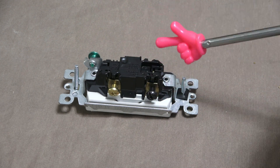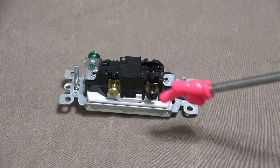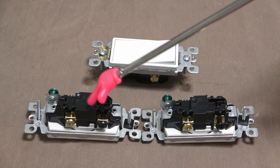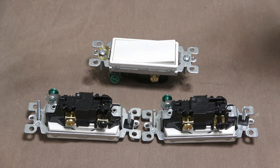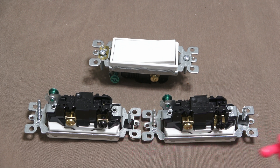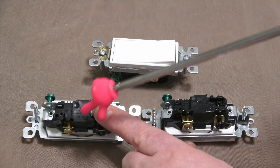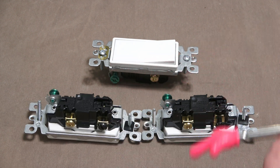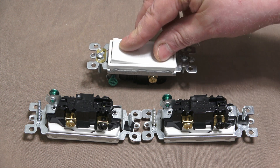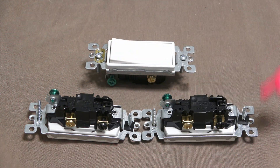This configuration may differ from an older switch in older homes. I've run into situations where none of the legs are color-coded — I'll cover that next. Having an understanding of how a three-way switch operates will greatly assist when wiring it up. Here's the black post on both switches: one can receive power from the breaker panel and this one will receive power from the traveler wires. You have a gold post here and one here — they send power back and forth depending on the position of the switch. Then you have your ground lug, and neutrals are all tied together.